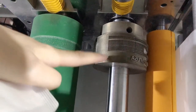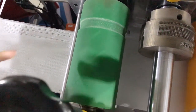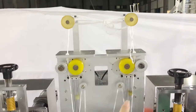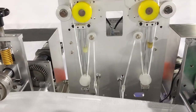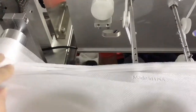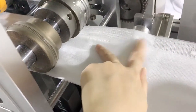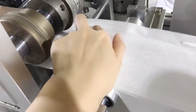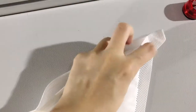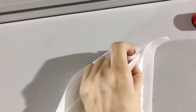It is driven by an ultrasonic motor with 20kHz, 2,000 watts. This is the feed roller. Here is our ear loop welding station — we don't have a separate ear loop welding station; the ear loop wire feeds from here directly into the fabric. This mold positions the ear loop — it positions both sides, and they will be welded inside here.